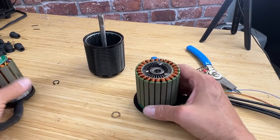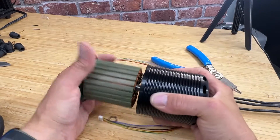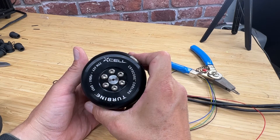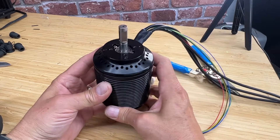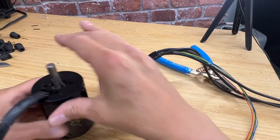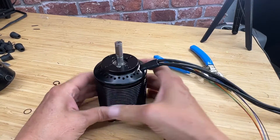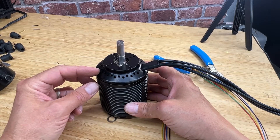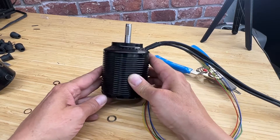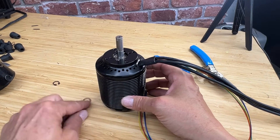We're going to have two different KVs. This one is 190 KV, which is good for 12 to 15S. And then we have 130 KV, which is good for 18 to 20S. You can see the difference in size here. The Turbine V2 is a beast of a motor, and to get the most power out of it you're going to want to throw a lot of amps at it. It can take 150 amps continuous no problem depending on ambient temperature, and it can take bursts up to probably 250 amps. There's a lot of power here, but you need an ESC that can deliver that kind of power — so that's something to keep in mind when upgrading your motor.